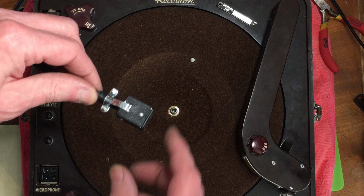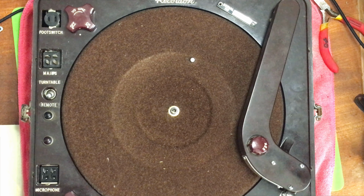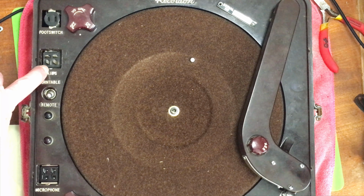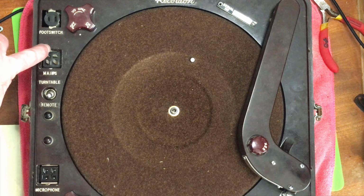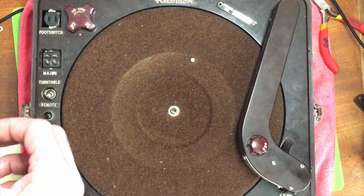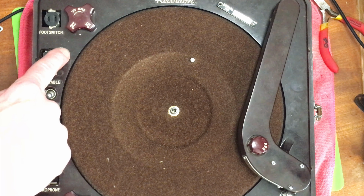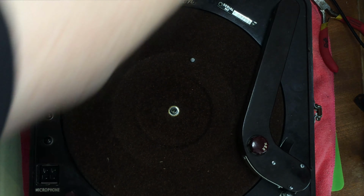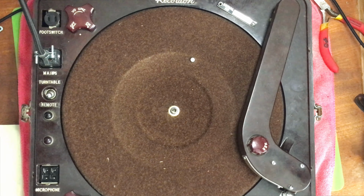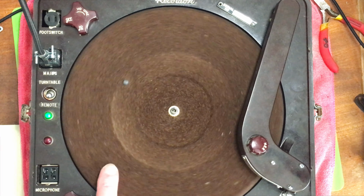I've also just broken the clips off this connector. I found a picture online that shows one of these with the connectors in, and you can see that in the original connectors, the right angle ones with the cables coming out the side of the machine, they have visible retaining pips, top and bottom. I'm guessing there's some kind of spring-loaded friction fit pins, just like rounded heads. But they did not have the big arms that this connector had, so I don't risk damaging the case by scraping those through it. So that's going to be just a straight friction fit for now. That's it, and the motor starts first time and has a good torque.